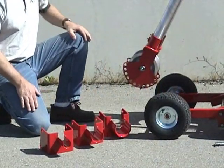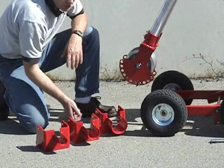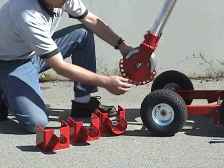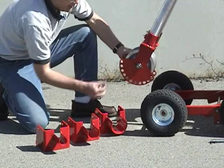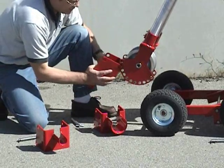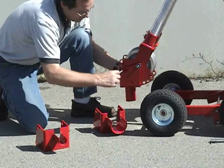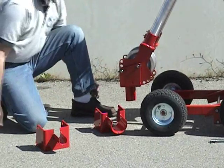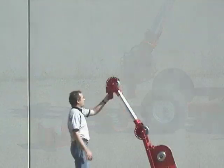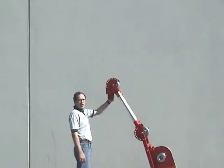There are several sizes of conduit adapters to suit various sizes of conduit. The adapters have an opening on one side to pass the rope through. To install an adapter, remove the locking pin and wrist pin. Install the conduit adapter and replace the locking pin and wrist pin. The conduit adapter can be adjusted to various angles to suit the direction of the conduit exit.